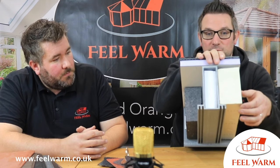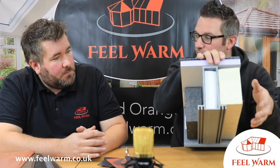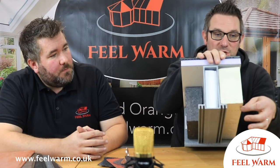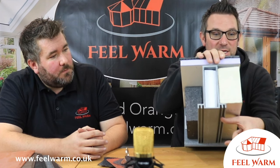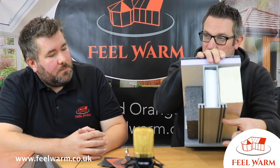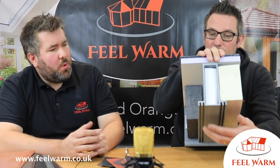And again, it was about 150 altogether, and now it's up to about 165. So what they used to have to do is get an insulated plasterboard on the bottom of here. That was a 50mm insulated plasterboard, so 62mm altogether. But now they've had to pull that to about a 72mm board, 72.5. So that's quite deep, isn't it?